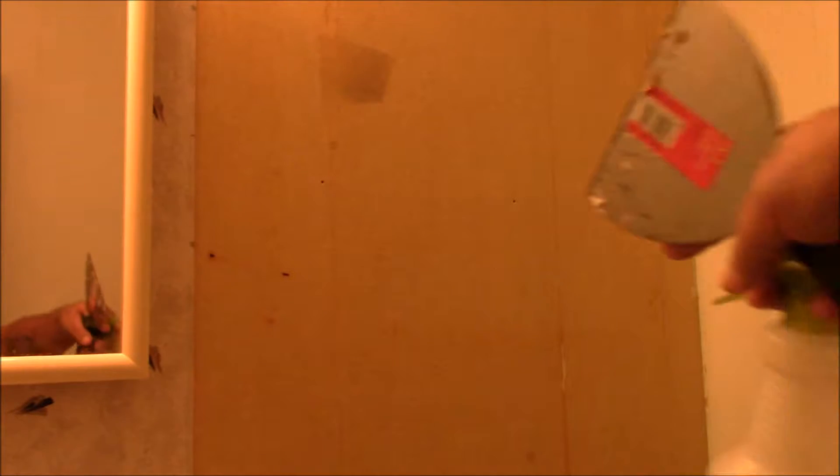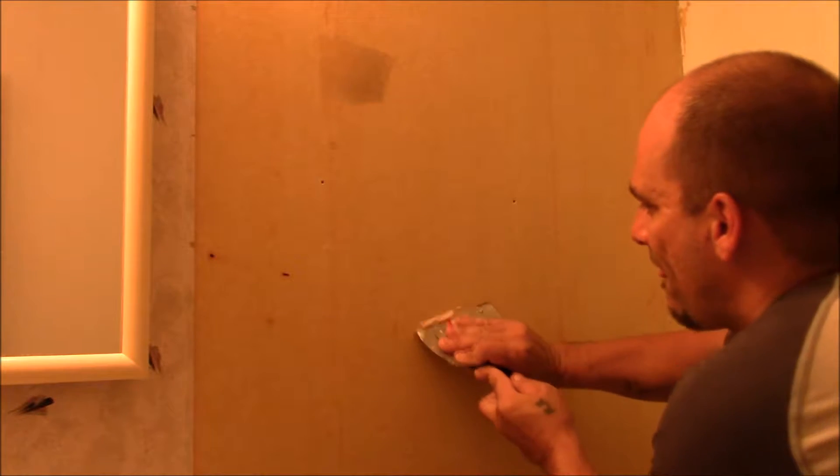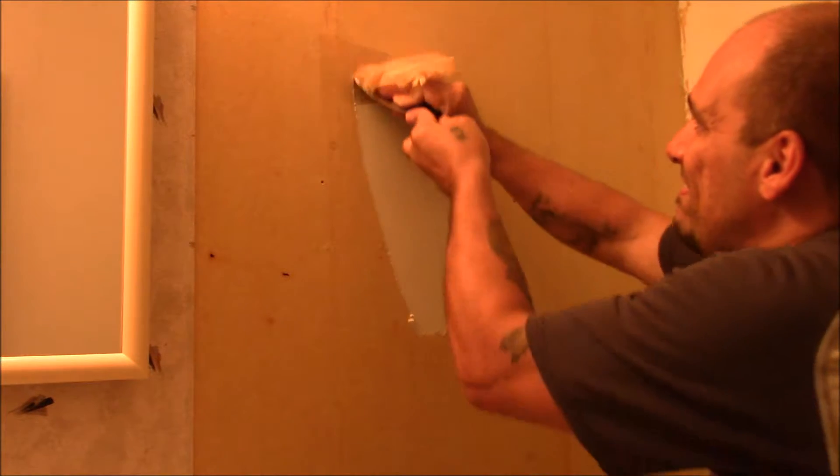Alright, last wall. You peel off the pretty paper on top and then all that's left is the glue. Spray it down with warm water or hot water, let it sit for a few minutes. It hasn't really sat for a few minutes, but let's see what we can do. Look at that. Voila!